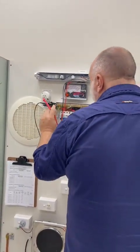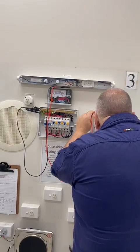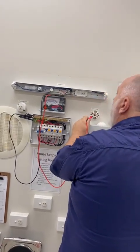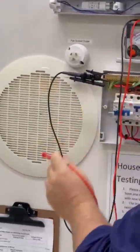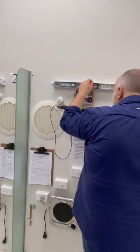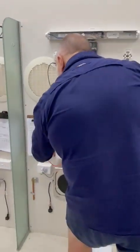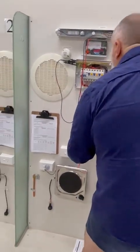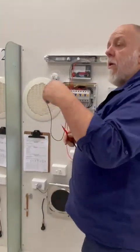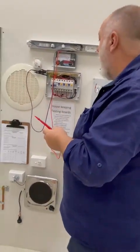The first item asks for the ceiling rose — I go to the ceiling rose earth and it's reading zero, so I'd put down close to 0.1. Done that one. The next is the fluorescent — that's reading zero as well. Then socket outlets one, two, and three — I work my way through with the earth pin. Once I've got all values, I go to table 8.2 as reference, add the two together, and see if they pass or fail.